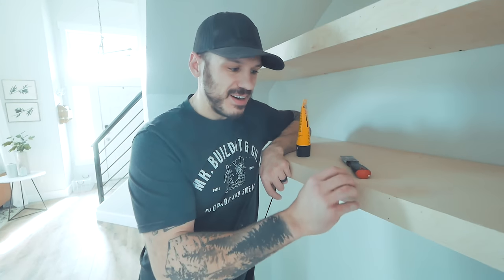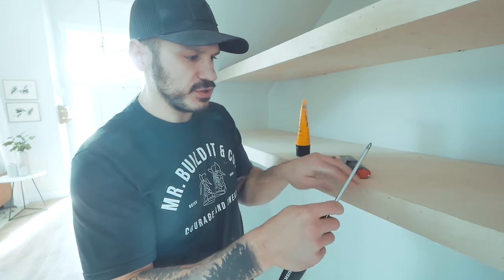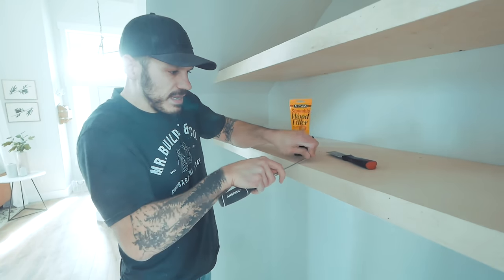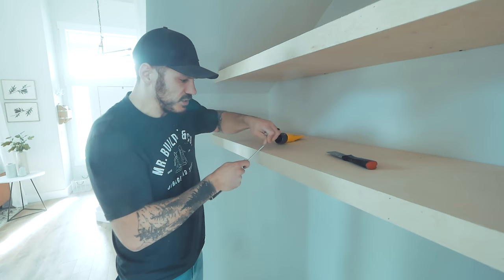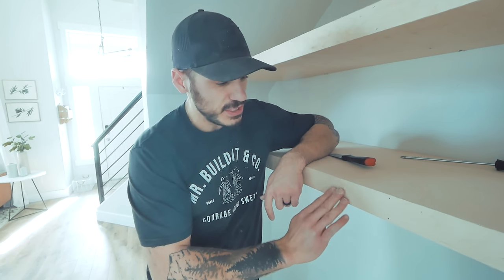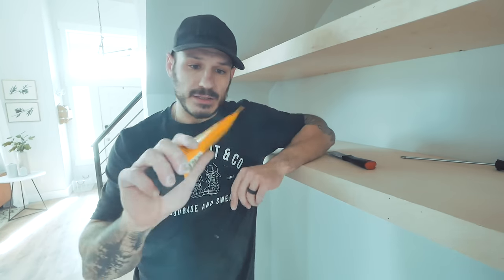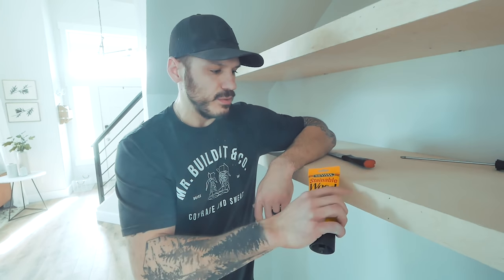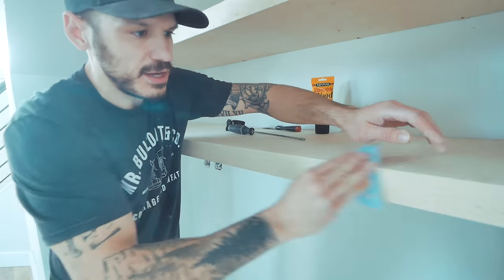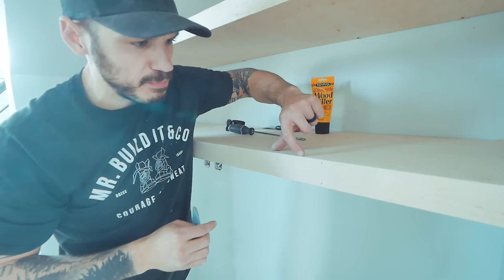So as you can see, some of these corners are not fully occluded — they're sharp, they're rough. This trick only works if these are nice tight seams. Here's the trick: you take a round-shafted screwdriver and you lightly start blending everything in, and as you can see it's already closing a lot of these gaps. You don't want to push too hard because you don't want to start breaking the plywood. Once you've got everything the way you want it, take a little light sandpaper and lightly brush it all in to create a nice smooth surface. Before I do that, I'm gonna take a little bit of wood filler and dab up all these little brad nail holes and some of the exposed plywood, and then that should get everything ready for stain.